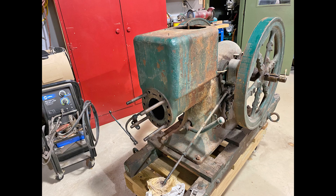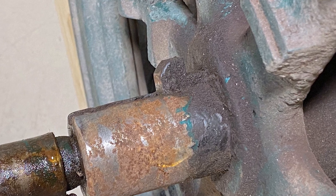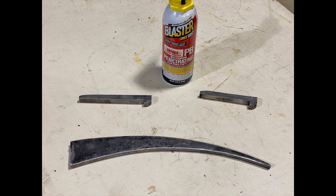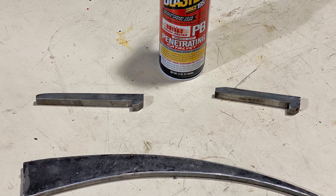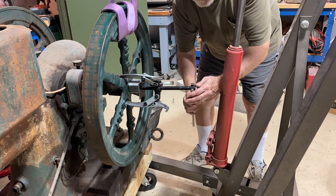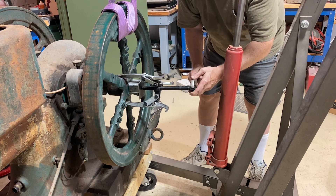It was time to tackle removing the flywheels. As you can see, the heavy-duty cart was a big help. This is a Gib key. If you want to know all about them and all about Type-M engines, watch Shopdog Sam's massive video collection on YouTube — he's the man. I learned about PB Blaster and a whole lot more from the Shopdog. I made a drawing and pal Jake Holmes plasma-cut a Gib key puller. The two Gib keys came out just as the Shopdog said they would. Go check out his channel — he's a lot more colorful than I am. Here's how I used an engine hoist and wheel puller to remove both flywheels.